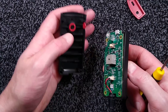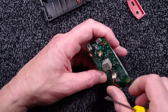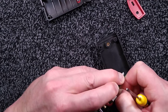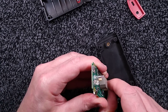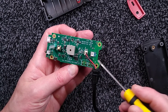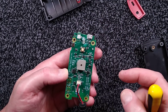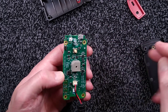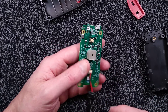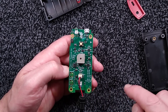If I take this cover off it reveals the circuit board. There's the sounder — it's quite a loud one. Inside we can see the little Bluetooth transceiver which it uses to connect to your phone, a couple of buttons, the charging port, and the LED with its light guide for transferring the light up to the indicator. The back is mainly a lithium cell at 1500 milliamp-hours. My colleagues report that in heavy use these have lasted well. I'm guessing from these little inductors that these are power supplies.